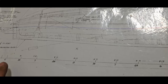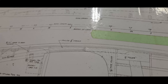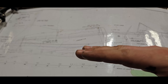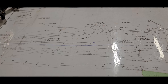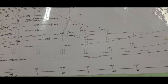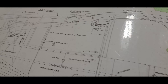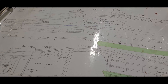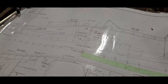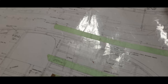Referring to the Cobra, we can take a look here and see the bottom of the boat — you can see a nice steady curve on this one, so it doesn't have a hog. Typically when a hog is designed in, it's to help the boat get up on plane and keep it there as it's going across the surface. We're going to attempt to locate plans for the Century, or similar versions, to see if there is a hog by design or if it's unfortunately due to oil impregnation. And yes — if you get these plans and you're skilled enough, you could build a replica Cobra using just the scale ratio and the plan itself.